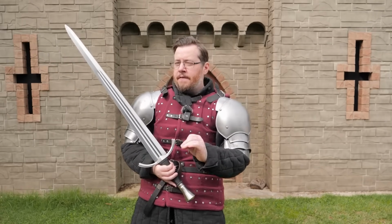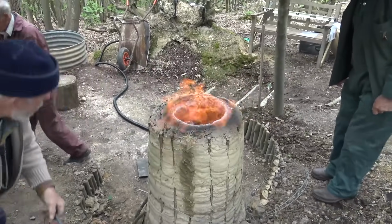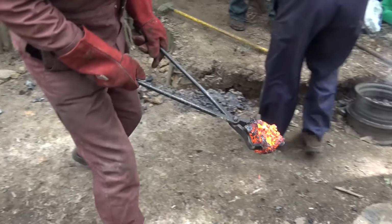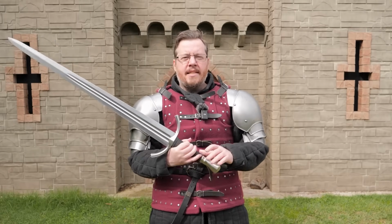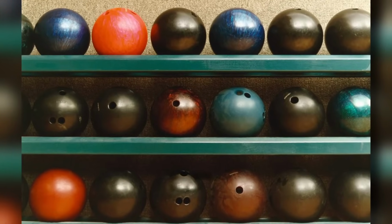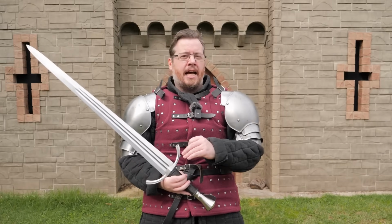There's also an added benefit when it comes to iron. As soon as you start smelting iron, because you often use a carbon-based fuel source, you invariably start to make byproducts of steel, which is much stronger. Steel being an alloy of iron with carbon diffused in it, basically gives the iron atoms less room to move around. Kind of like if you had a room full of people and then you filled it up with bowling balls as well, filling up all those gaps, making it even harder for people to move around. It's kind of how it works with adding carbon to iron.